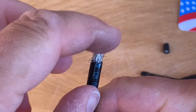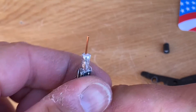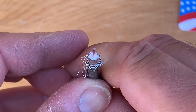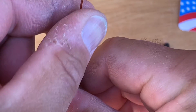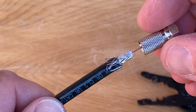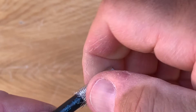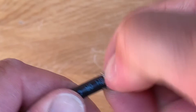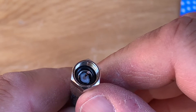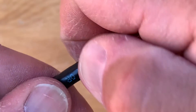Now all you have to do is pull back this braided shielding. Make sure none of that touches the center conductor, because that could short your TV signal out. To make this as DIY-friendly as possible, we'll just add a twist-on connector that has threads inside — that will bite into the jacket of the cable and make a solid connection. Just twist that on until the white dielectric is flush with the bottom of the nut inside the connector.